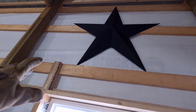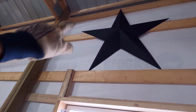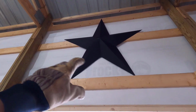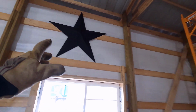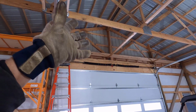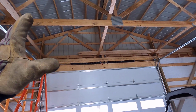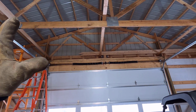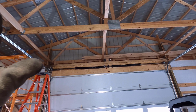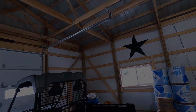And again, the template will likely be like lath material, 1/8-inch wood, and it'll just be a triangle, and I'll drill holes where the fasteners are going to end up going. Then I'll take that and bring it onto the outside and kind of figure out where the center is and mark where my hole locations are going to be. That's going to be a long, drawn-out process, and I'm going to have to do that on a nice, calm day when it's nice and warm out. So that could be a couple months away.